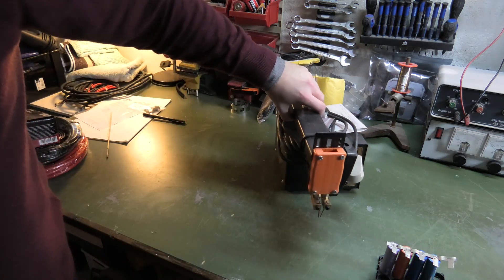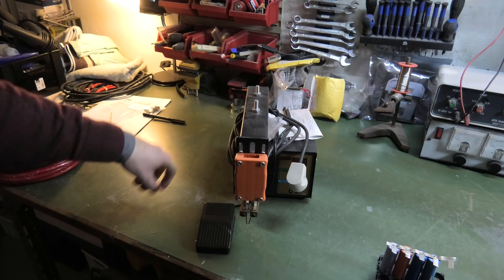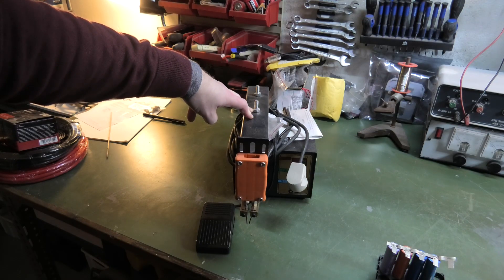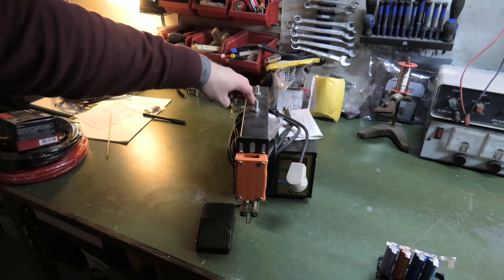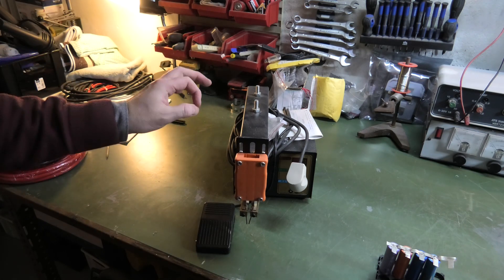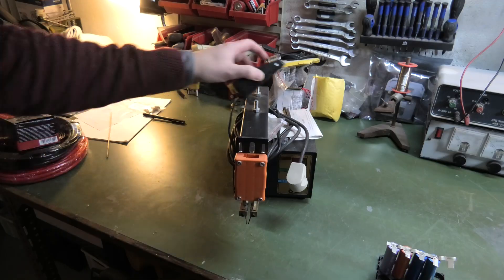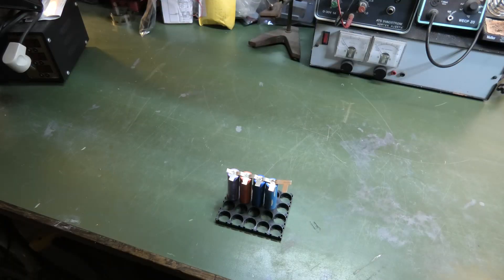I gave up on that and moved on to the next one — a professional spot welder that I managed to persuade Banggood to give me for a review. As it was a professional one, it turns out this draws a crazy amount of power. I have 13 amp fuses at 220 volts and those just blew like nothing. I hooked up a generator to it and was able to do some spot welds on low settings, but to use this I will have to make changes to my electrical system, so I kind of gave up on that idea.